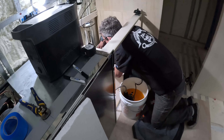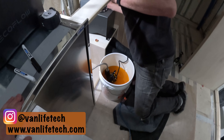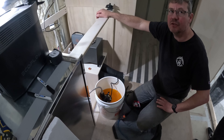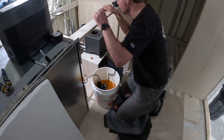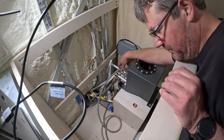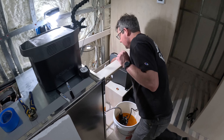Troy is pumping glycol in there — we're filling the system up. It's always dyed orange. They use a non-toxic propylene glycol with a special mix of anti-corrosion inhibitors. Coming from hydronic heating, they have what's called a fill-and-purge assembly with a forced fill pump. By forcing all the air out of the system, it will run almost silently because there won't be any air in it.